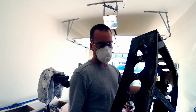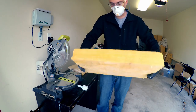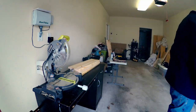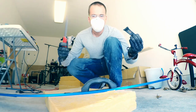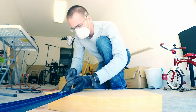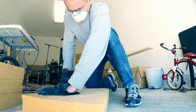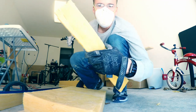So now that we've got the look we want, we're ready to cut the insulation and put the fabric on it. If you're curious to know what these are, these are scrap — three inches thick, Owens Corning 705. We're going to cut this into 12 inch by 20 inch chunks. We've got a straight edge to work with and our insulation knife. Just like that.